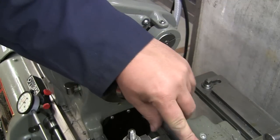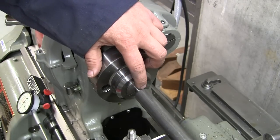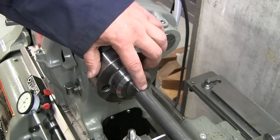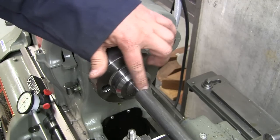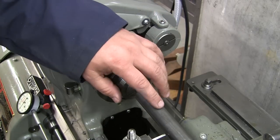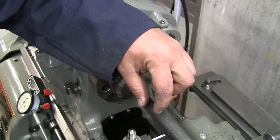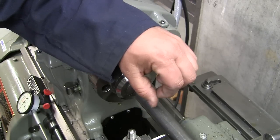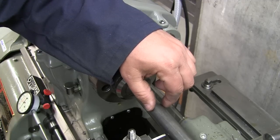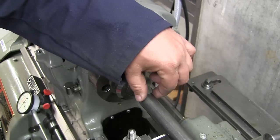The first thing that I want to do to turn this screw is go from this side. This is the side where the little threads are going to be that holds the ball crank. So I need to come over from this inside edge over 5/8. Now there's two clearance sections, 1/8 wide by about an eighth or so, about a 16th of an inch deep, that divide a couple of the different diameters here.